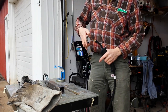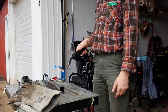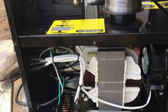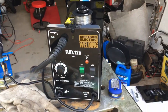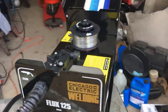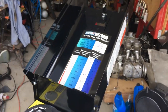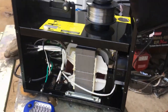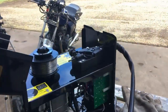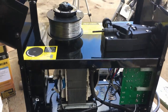Leave the nozzle off and trim your wire short. I'm probably running with maybe 3/8 of an inch stick-out — seems to run pretty good. So the initial unboxing review: I'm actually impressed. It's cheap, there's no getting around that, and it doesn't come with a lot of settings. I have yet to try it on thinner stuff — we'll do a full weld test in another video. But initial impressions? It's not bad. It's perfectly serviceable for the home hobbyist.